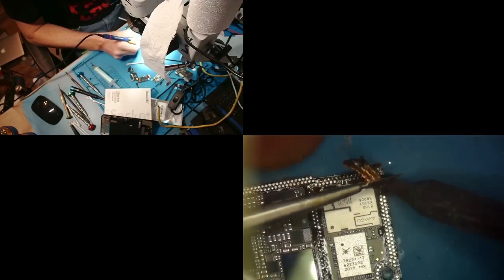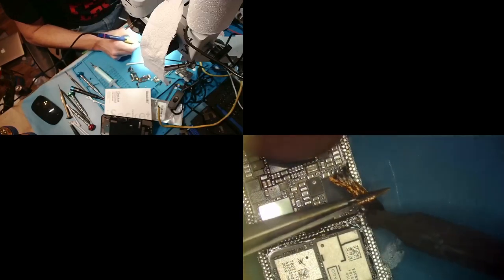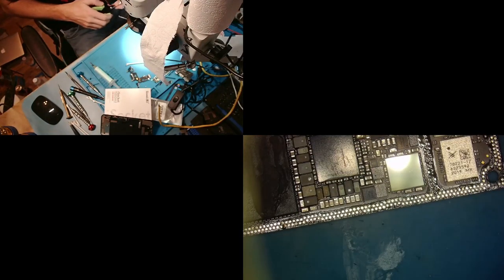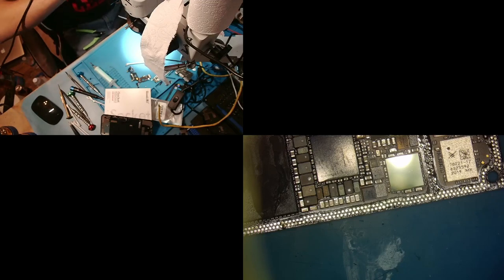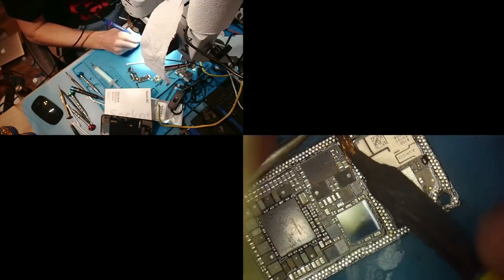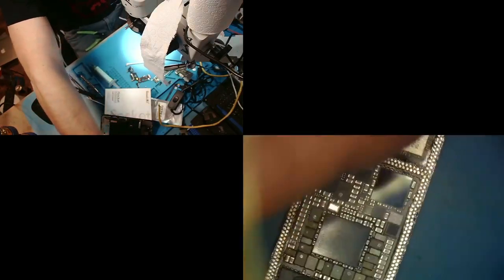Now, again, another reason I'm wicking these is because I am expecting a pad to come with it. And if that happens, that's just easier to identify what is wrong with the device, right? If I don't wick it and I just replop the sandwich, it could work. It probably will. But it could come back with an issue, and what I've noticed is if I wick them, pads that are barely hanging on will come right off, and then I can easily identify and repair it properly.